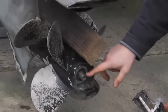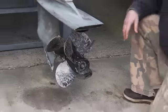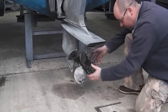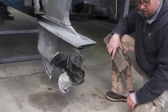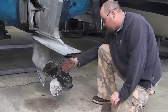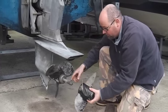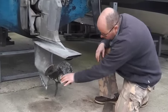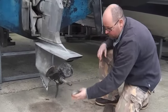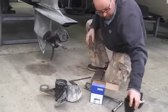It's on a 20mm thread here and in the middle there is the locking nut. To get the props off — these have been off before, you can see there's plenty of grease. You can tap them gently. These are quite soft aluminium propellers. You can use a little bit of leverage in between, but I know these have been off quite recently as you can see there's quite a lot of grease on them, so they come off quite easily.